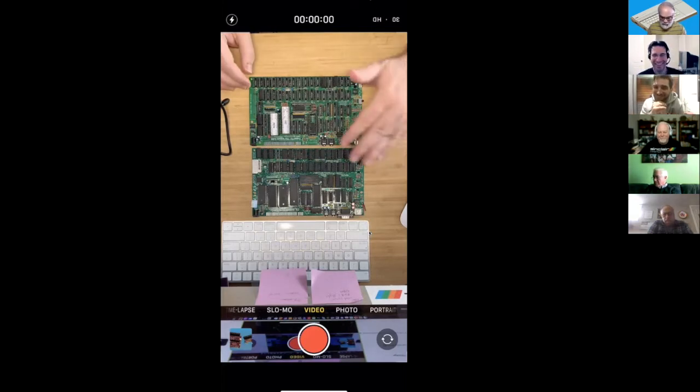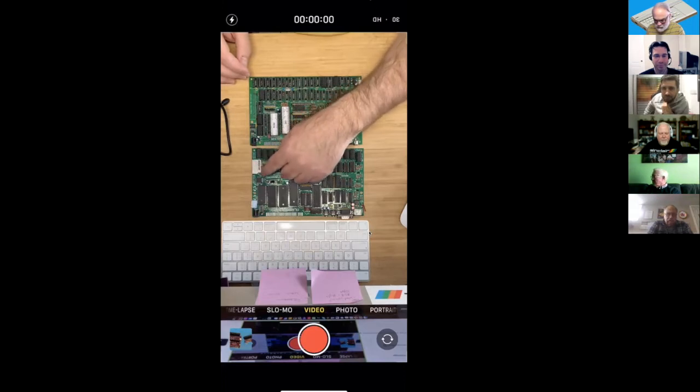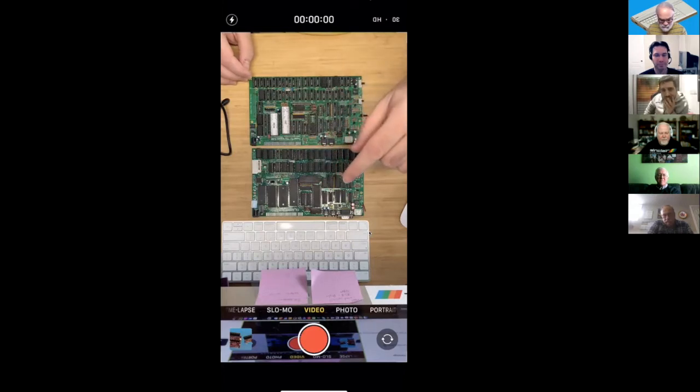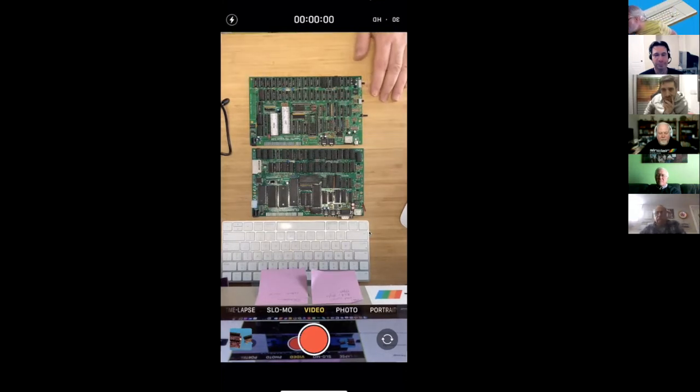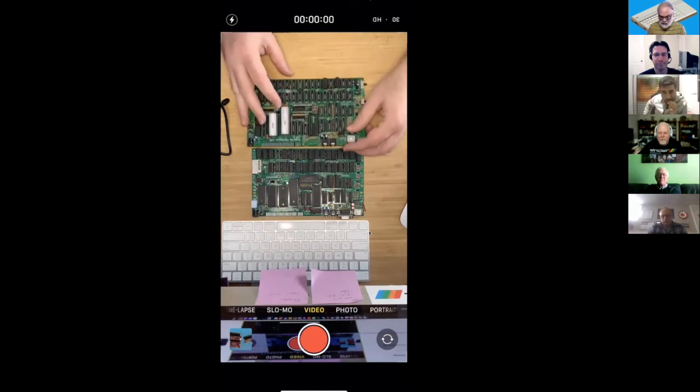And this one, he calls it a Nuvo. It's a 128K machine. This one has a built-in DivMMC. So there's the little Xilinx CPLD maybe, and the SD card connector. I don't think this one works yet. When I turn this one on, it gives off a garbage screen, so I've got to figure out what's wrong with it. But I did manage to assemble one and get it working. It's a fun thing, and you like the squishy keyboard and whatnot.